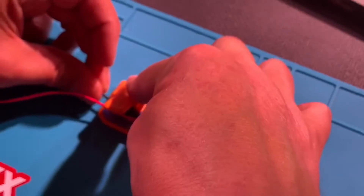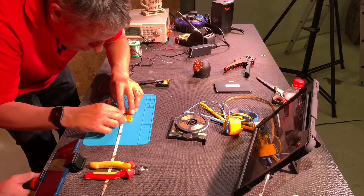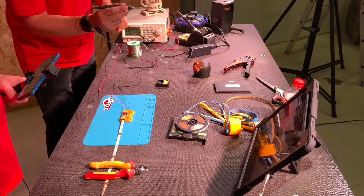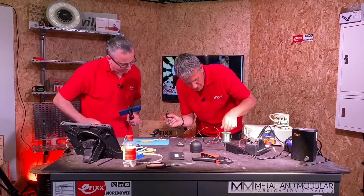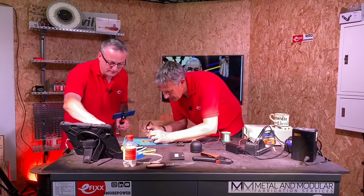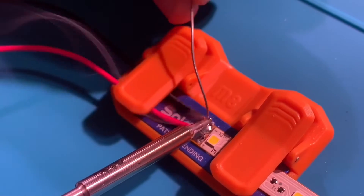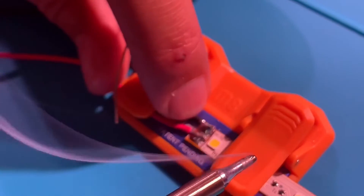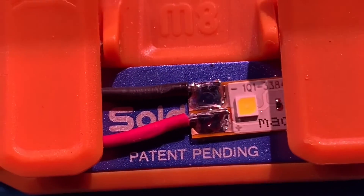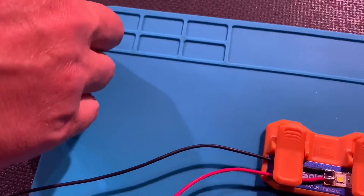So we're going in now with the negative in order to make that connection. Just a little bit of fiddling around, making sure you get it placed correctly on top of that soldered pad before you come back in with the soldering iron. What's your feelings at the minute on the soldering iron? It's good - it's very lightweight. You might slip - I'd be careful you don't slip along there and touch the element. A little guard there might help, a shroud stopping your hand sliding down. Okay, let's see if you're any better this time. You're chasing it around the pad there. Considering that's pretty much live on cam, I think that's a pretty reasonable effort. But of course, as always, the proof's in the pudding whether it will actually energise.